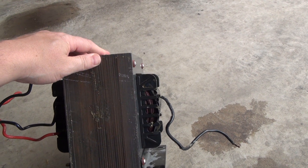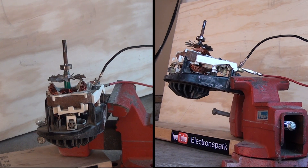It's a nice, hefty transformer. The armature of this motor is only connected with one bearing. I tried to get a motor like this to spin a couple videos back, connecting through the brushes, but it wouldn't do it. So I'm connecting through the field windings, and that will give it enough torque to spin. I tested this motor a couple weeks back and it had no problem taking 150 volts. So I'm connecting it through the step-up transformer this time — maybe I can get it to go a little bit faster.